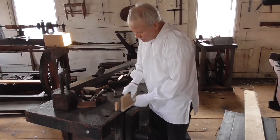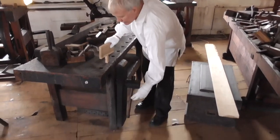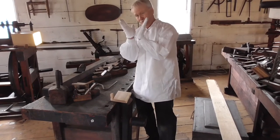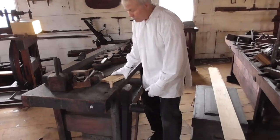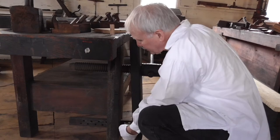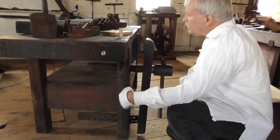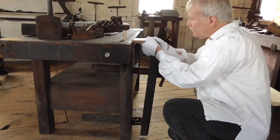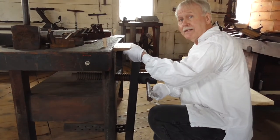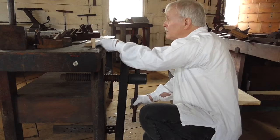This is the forerunner of the front vise that we're used to in shops today — this is called a knee vise. What would work here: if I want to tighten the board up, no problem. The thing is, as you turn it out, this angle becomes more and more. So if you want to put a board in this way, you'd have it on such an angle that it might want to pop out. So the way the knee vise works: this pulls out here at the bottom and you put a pin in here, and that would hold this so that when you tighten it, it would work just as well as a modern vise. The only thing is you have to mess with this pin, which is no big deal, because you're usually working with the same board for a while.